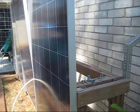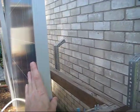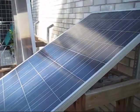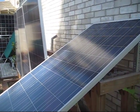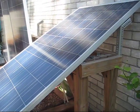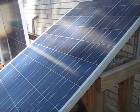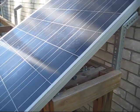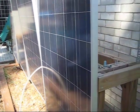Another question people have is what angle do you put your solar panels at? It's a very simple answer — whatever your latitude is. Since I'm down in the Houston area, my panels are at about a 30 to 32 degree angle. That's a fixed angle; I decided not to go with adjustable angles. I'll put some links down below if you want to find out what your latitude is, and if you want to be able to adjust your panels, I'll have a calculator and links down below this video for that. But for me, it wasn't worth the hassle or the time or the building construction needed to make that work. A fixed angle gives me the power that I want. I do lose some percentage, but it is a small percentage and I'm happy with what I'm getting.